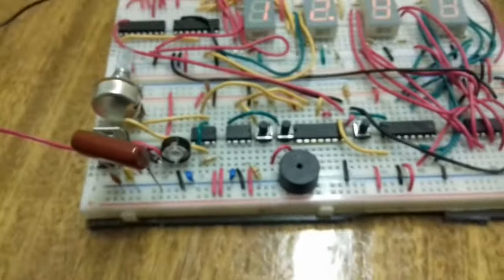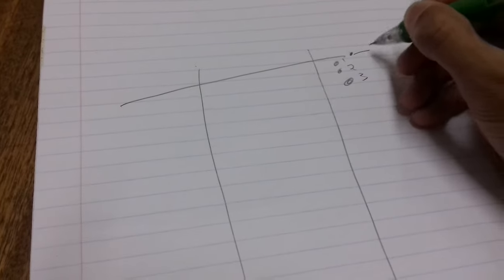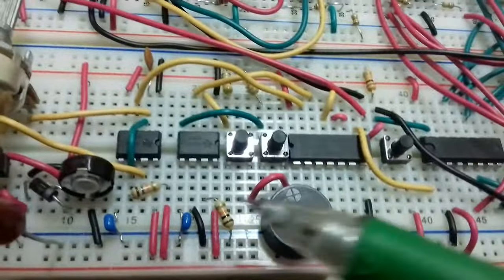For example, imagine this is a racing track with a countdown: 3, 2, 1. After one, you can trigger the start button automatically. That trigger connects to the start input of my circuit. All the cars or runners go, and at the end of the track you can place a laser and a phototransistor which will trigger the stop.